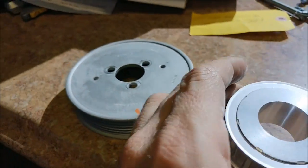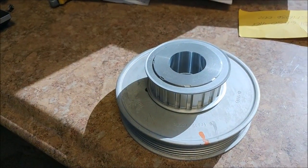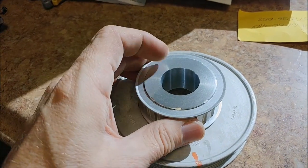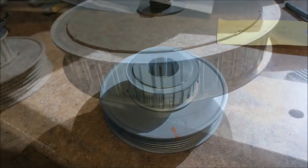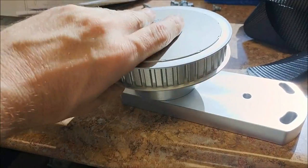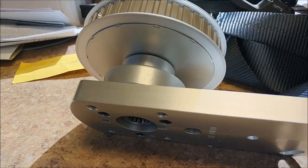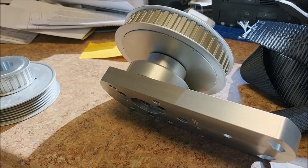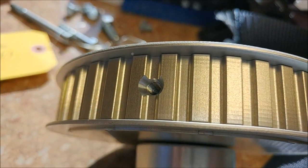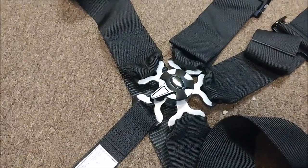These pulleys arrived — the ones I special ordered. This is for the governor drive and we needed ones with a larger diameter. That one is going to bolt to the water pump pulley on the engine just like that, so we have to drill those three holes through there. The larger one I've already got bolted on — even though it has a slightly larger diameter by about four thou, it seems to be fitting well. We'll give it a try and if it doesn't work we'll shim it, but it's not moving around at all. I tightened up the little allen bolts and sorted that out.